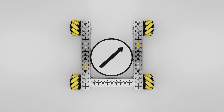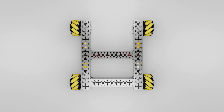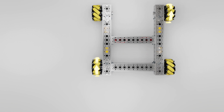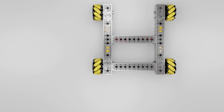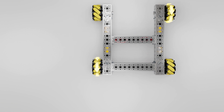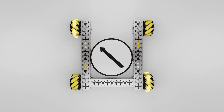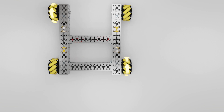If I was trying to move forward and to the right, I would move this wheel forward and this wheel forward, giving a nice 45-degree angle assuming you're giving the same amount of speed to each motor. Likewise, you can run those backwards to move backward and to the left, and if you're trying to move forward to the left, move these two in this direction.